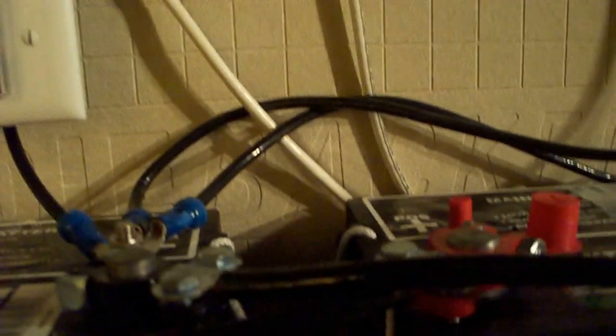Right now I'm going to go outside and show you the actual panels. By the way, I use six gauge wire for everything — just to keep everything safe. I use screw-type connectors for the batteries to keep everything simple. I bought these batteries at Batteries Plus for about a hundred dollars each.